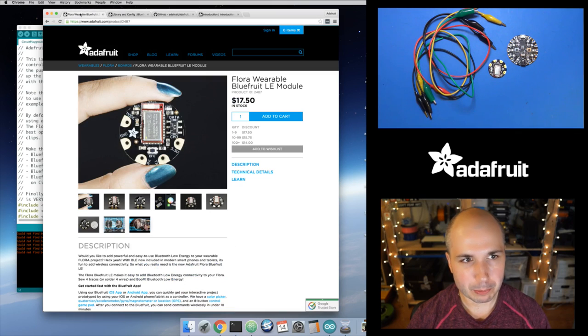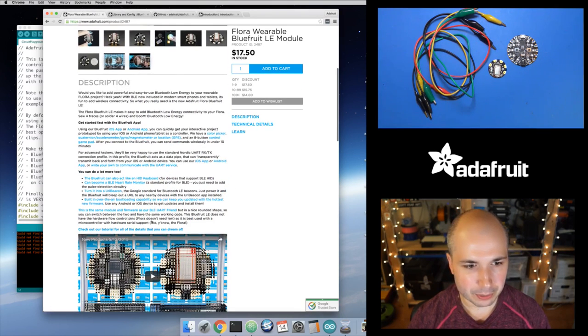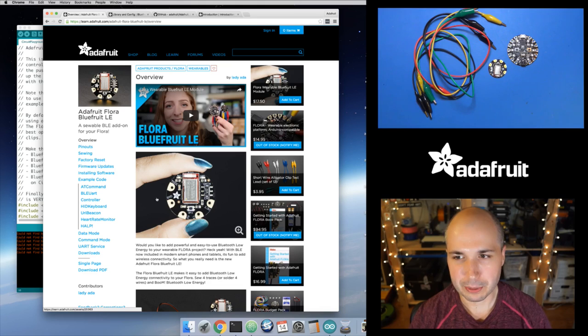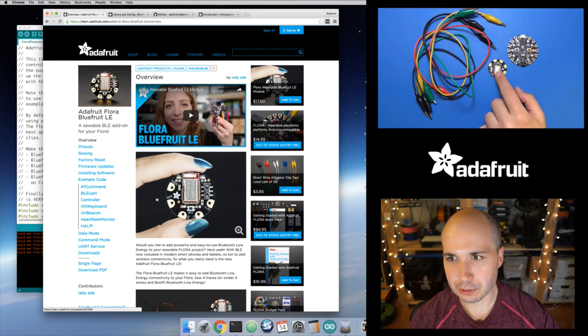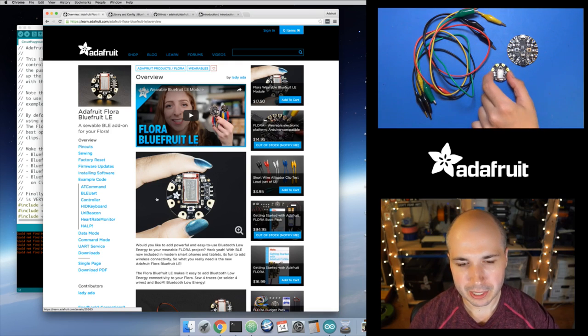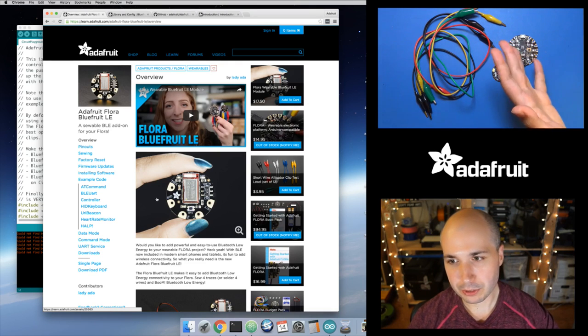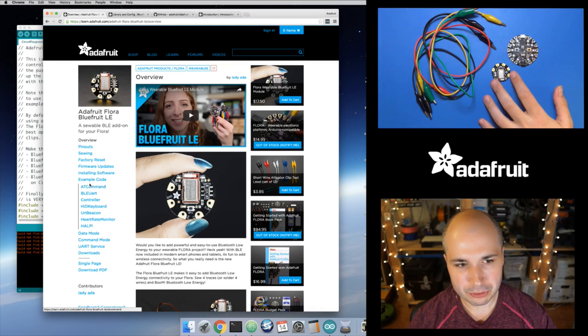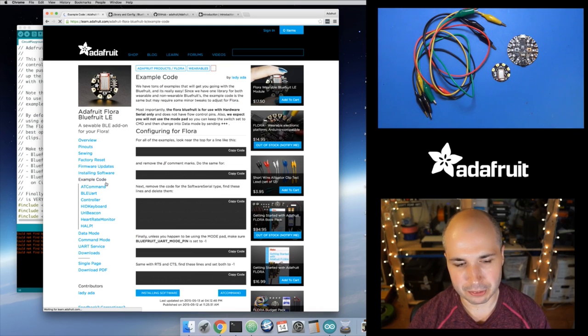You're going to want to go through the Flora BLE module guide. So go to this page and go to the tutorial here. And just like any product or project that you're working on, test each component individually. Luckily there's no soldering you need to do for this board. So as soon as you get it, you're ready to go. But connect it up to a Circuit Playground or another Arduino or whatever you have, and just run through some of the examples that they have here. There's example code, like just talking some basic AT commands to it.